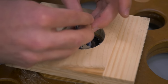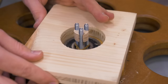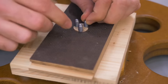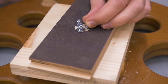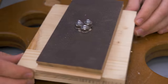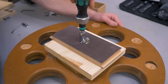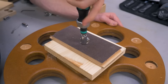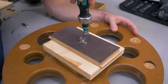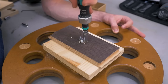Then a second one for the top. I've got that kind of secured with a rubber band. Now comes this piece, and then another piece with a smaller hole where that fits through. Now I can add a washer and a nut to everyone. Now they're all starting to get tight and I can go around and start pulling on everyone, and slowly pull out the bearing. Only problem — I can't see my progress and I don't know if it actually works. It should. That sounds pretty good — it sounds like it's coming out.